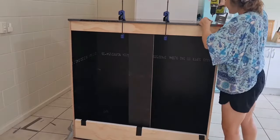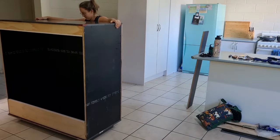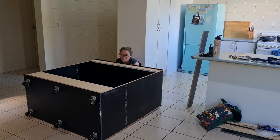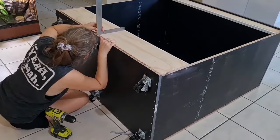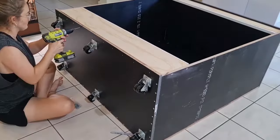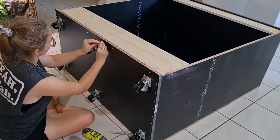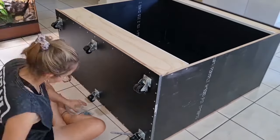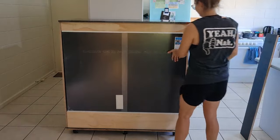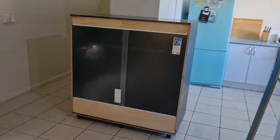This is how I embed the screws: I use a smaller drill bit first, then a bigger drill bit to drill a shallower but wider hole so the screw can sink in. You can then hide it with wood putty, sand it, and paint it — you'd never know the screw is there. The top lip is totally secured. There's also a wood panel in the middle to stop the lid from sagging. I'm flipping it over to secure the substrate lip the same way. With the amount of screws I'm using it's a bit overkill, and I did run out, but the structure is looking absolutely great.